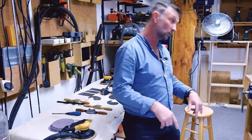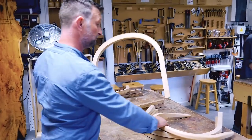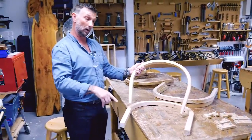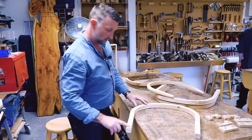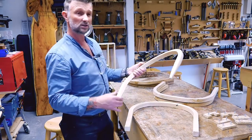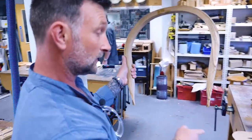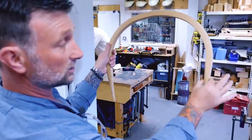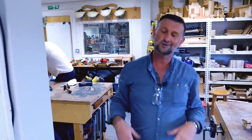That's kind of chair seats covered in this room. After we've done our steam bending session, we'll be shaping the steam-bent bows — there are two bows: an arm bow and a top bow that comes into the arm bow. The guys will be putting in the detail, putting in the shapes, and smoothing and rounding over the arm bows as well as the top bow. Customers have a little bit of freedom when it comes to shaping — a little short taper, a more one-sided taper, or a longer slower taper — but all coming down to that same kind of half-inch peg size. It's quite a nice room — a little bit of peace and quiet after the angle grinding and Arboteching.